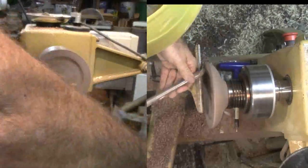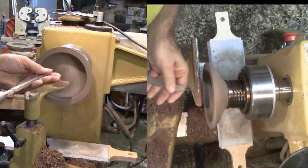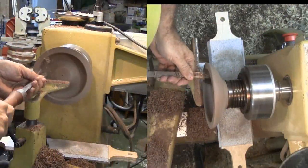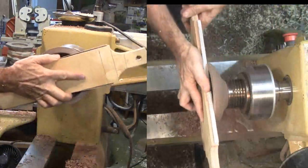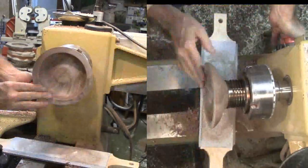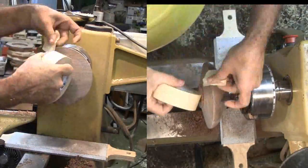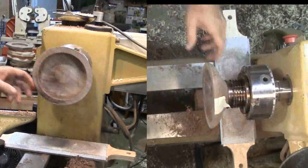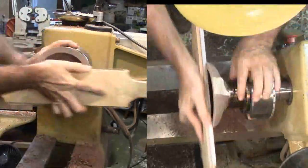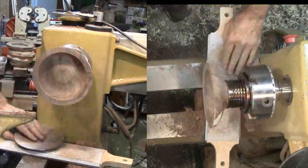There will not be much wood to work with. Near the end of the hollowing, I'm switching to a round nose scraper. I can take light cuts and leave it clean. If anyone ever cuts this timber open, they'll find a smooth surface — but then the tea light will have been destroyed. I'll also sand this side with a sanding board. I'll also mark an ideal grain alignment with masking tape before gluing the top and bottom back together.